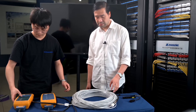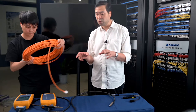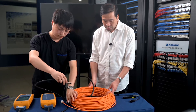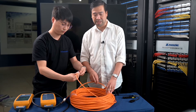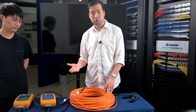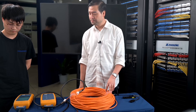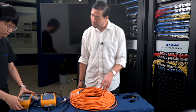Now let's see what happens — that's very quick, only five or six seconds. We changed to the CAT-6 cable. This color is orange, which in Zhaolong means the outer jacket is low-smoke zero-halogen (LSZH). Let's start. This time we still choose the TIA standard for CAT-6 permanent link with all parameters. It passes, and the next margin is about 6 dB.